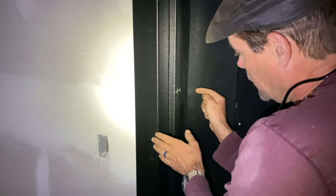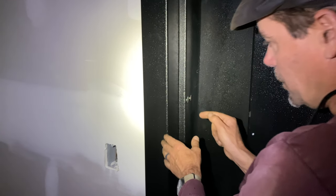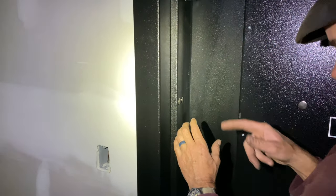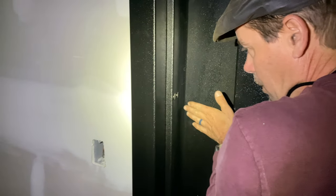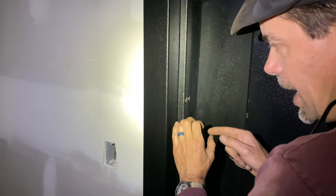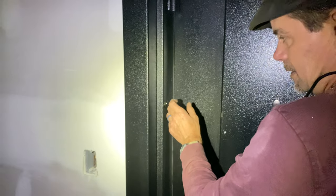But what isn't cool is you have to drill a hole just through the steel without going into the concrete, with a steel bit, then get that big enough, and then put a concrete bit, a masonry bit, on to go on through, and then run your lags. But the lags they give you are not adequate for concrete. They're only good for framed walls.